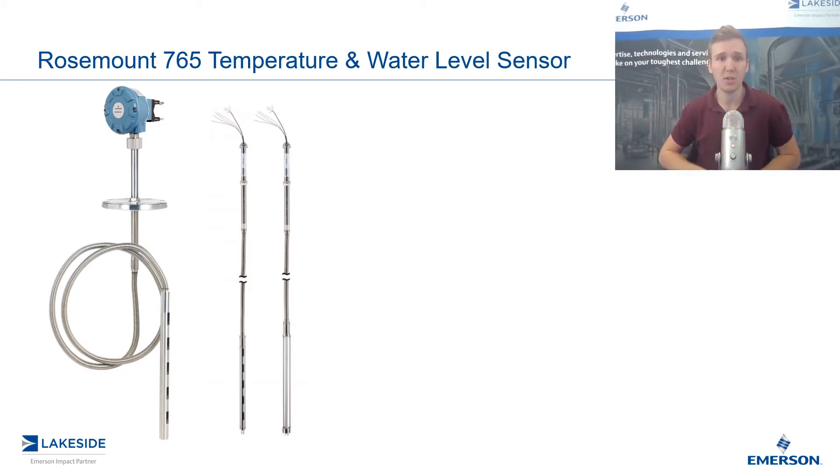So today we're focusing on temperature, and we actually have not just one measurement with this temperature sensor, but up to 10. In fact, it's known as a multi-spot sensor. This is really important because in these tall vessels, you can imagine how much your product's temperature changes, especially if we have a 100-plus foot vessel. By utilizing up to 10 measurements, we can get a better average of your product's temperature, which improves our calculations.